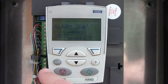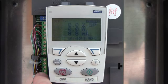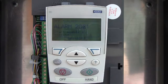The reason they do that is for safety. It's a way of basically, if you had it running manually in hand mode, that safety circuit will still drop the drive off and disable the drive so it releases the motor. You can also have it set up for a run enable where the drive will just stop but it won't give you this alarm, but it does the same thing.